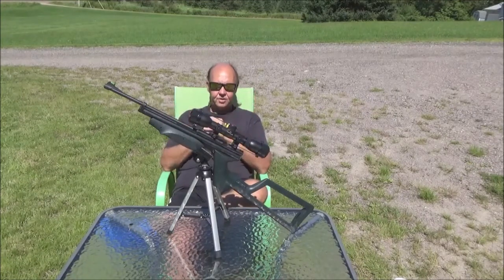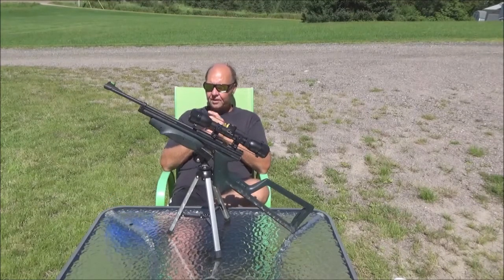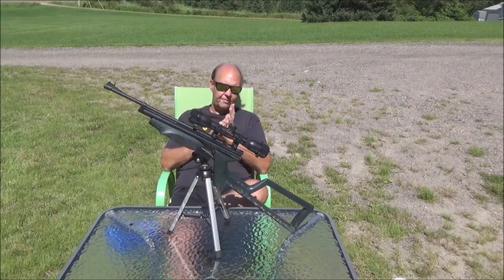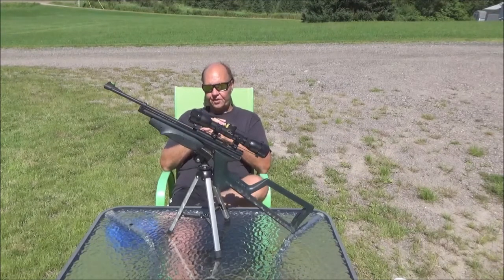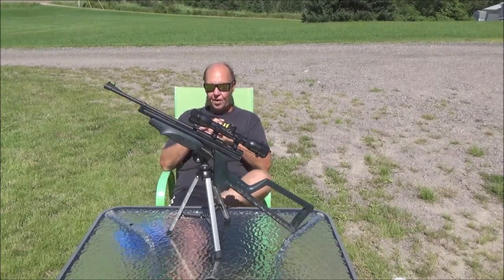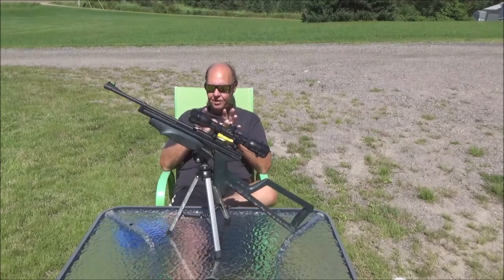I did lighten the trigger pull up quite substantially. I had a spare couple of springs to guinea pig with, so I sanded about a coil and a half roughly off and popped it in, and it goes off rather easy now. It's not as feather light as blow on it and it goes off, but if you dropped the gun, I'm sure it would go off, so it's pretty sensitive, which is the way I like it.